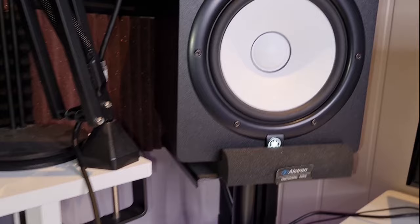I should point out that in some cases the noise might actually be caused by faulty equipment too, so you'll have to do some troubleshooting to figure out exactly what's causing it. For example, if you have a hiss in one studio monitor but not the other, then try to switch the signal cables. If the noise moves to the other side, you know it's not the monitor.